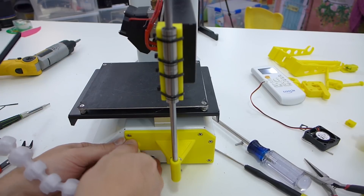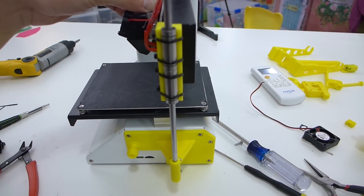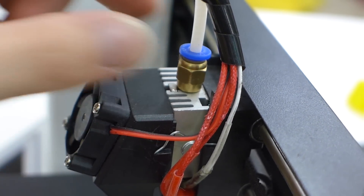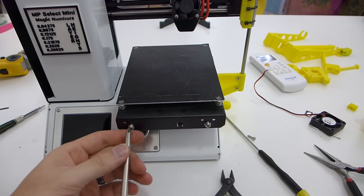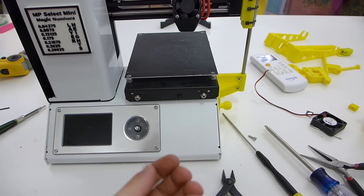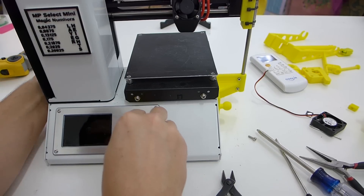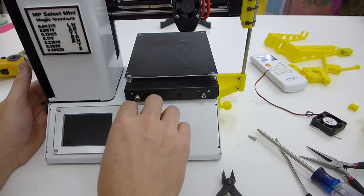For today I want to see if I was able to fix my under-extrusion problem, because this thing clogs up a lot. I think it was because this was really loose — there's a little nut with a set screw that I tightened all the way in. Now this doesn't move at all, so we'll see if that helps. I also have a new, bigger knob for the navigation button, because the stock one is tiny. This makes it easier to click and feel each selection — I've accidentally printed the wrong item like 500 times.